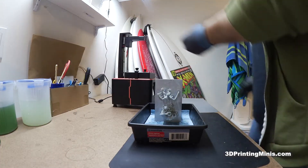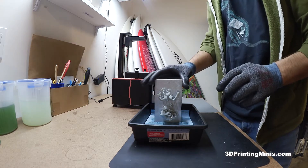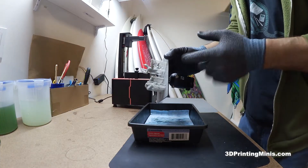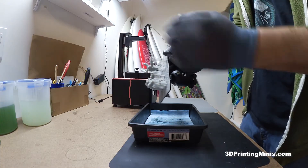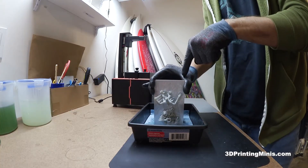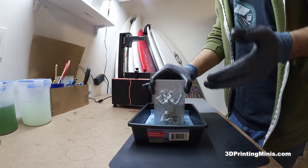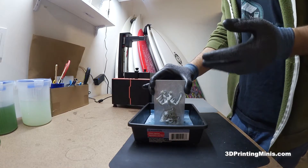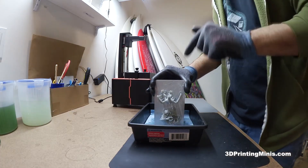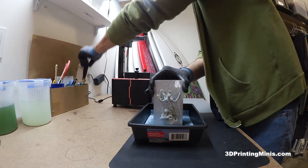Ladies and gentlemen, I am not — when I scrape this — I am only going to hold the plate by the plate. I am not going to hold the plate by this bracket, because this bracket has a screw and that's the screw you loosen when you level your plate. If you're really cranking down and holding that bracket, you're going to unlevel your plate and mess up your next print. Don't do that. I did that a lot when I first got my printer and was having failures every second or third print for no reason I could discern — that was the reason. Once I started holding the plate by the sides, nice and firm, I have never had a failure because of that.